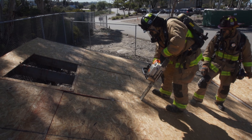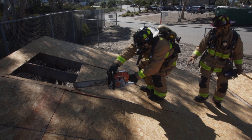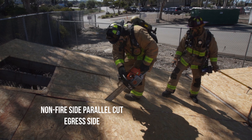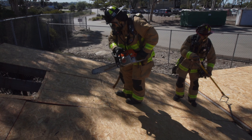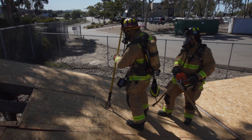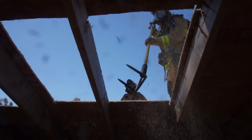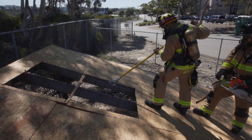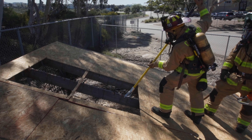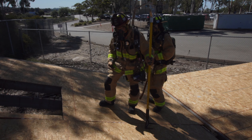Watch the sounder — he is holding the rubbish hook with the hooks down behind him, which gives an indication of the edge of the roof line. The final cut is a parallel cut on the egress side. As always, to ensure safety, communicate with interior crews prior to punching through. Confirm success and exit the roof safely.